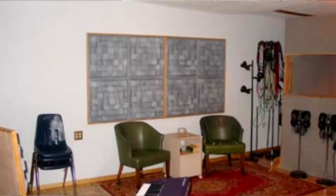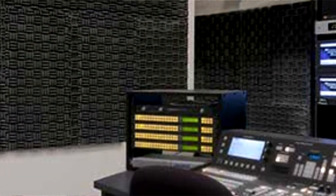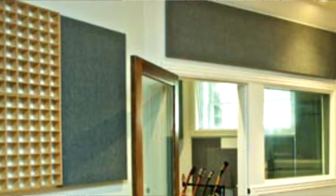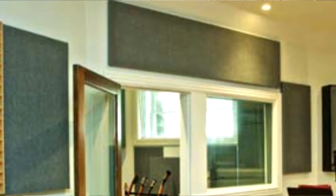You have to remember that you want balance. You want both low frequency absorption in your corners and also some high and mid frequency absorption or diffusion along your walls. One of the best tricks is to take a mirror around your room, and anywhere you can see the reflection of your monitors in that mirror, you may want to apply some absorption or diffusion depending on how you want the room to sound.